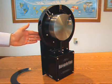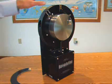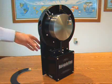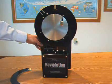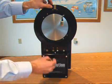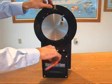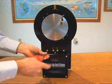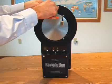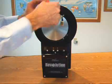The backside surface of the rotating collar and the mounting block on the master control unit should be in alignment with each other, and there should be approximately 3/8 of an inch gap between the stationary coil and the rotating coil on the rotating collar assembly. I will now complete the installation of the remaining half of the power coil with the button head cap screws and washers provided and using an 1/8 inch Allen wrench. In order to obtain the correct alignment between the rotating collar and the stationary power coil, you may have to loosen the rotating collar and adjust its position on the shaft.